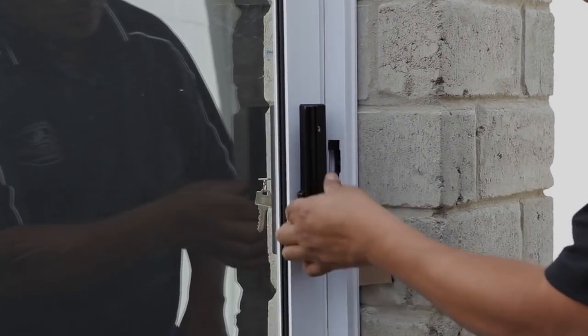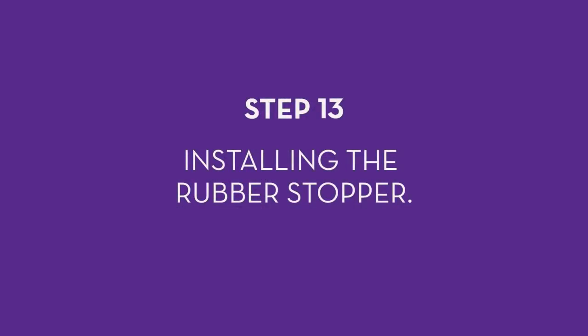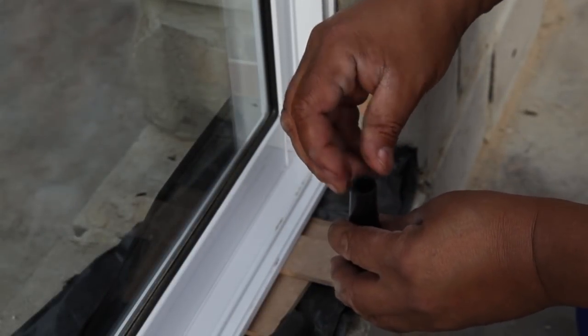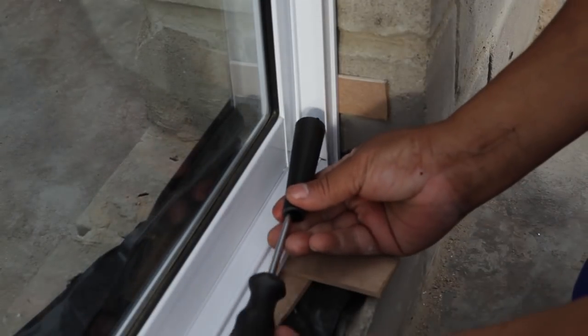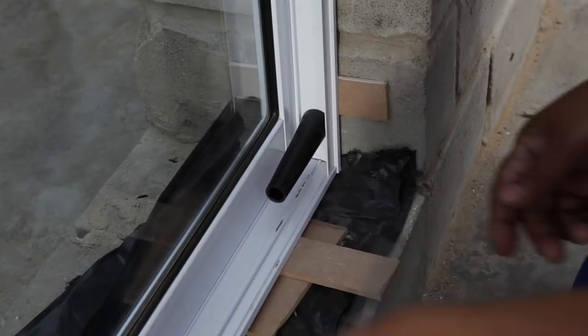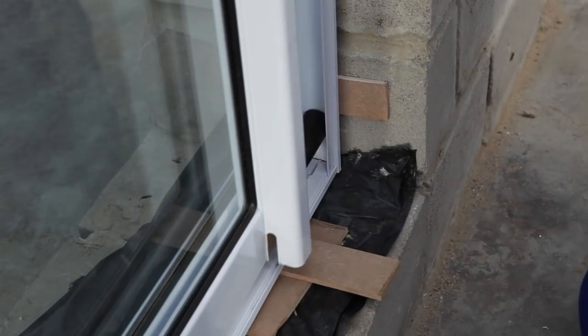Check that the lock works. Step 13: installing the rubber stopper. Fit the rubber stopper to the jam rail against the wall. Insert the screw into the rubber stopper, then insert the stopper either into the pre-drilled hole at the top or the one at the bottom. Tighten it to the outer frame.